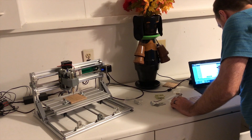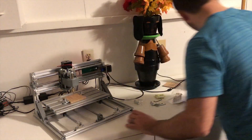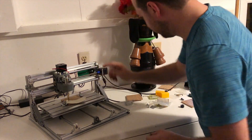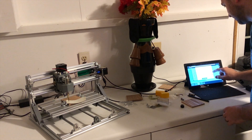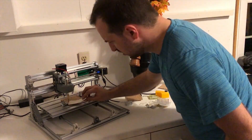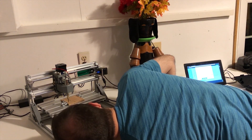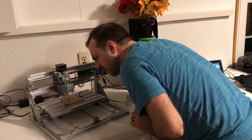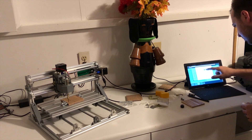A little bit more, a little bit more — one back. A trick I learned for zeroing: you have a little piece of paper here, and as soon as it's pressed down, then we are good to go. So we're still in the process of zeroing. And there you go, it's in contact pretty much with the wood — it is just touching the wood. So now I've homed it to the bottom left hand corner of the wood, which means now confirm home position. I'll raise the bit slightly before turning on the spindle.